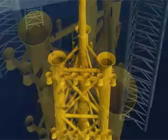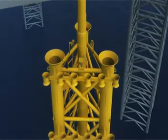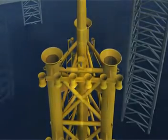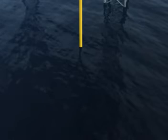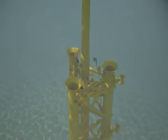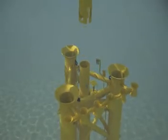A gyro is installed to orientate the subsea structure, and disposable cameras are fitted so that conductor stab-in and cement returns can be verified in real time and recorded. Installation of C-Swift requires neither divers nor ROVs. The center slot conductor continues to be run with the subsea structure attached. When the structure reaches the required orientation and height above the mudline, the conductor is cemented in position. The landing string can then be disconnected and withdrawn by disengaging the double J running tool.